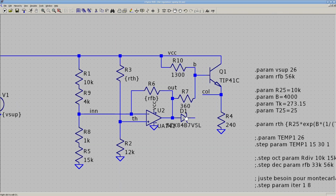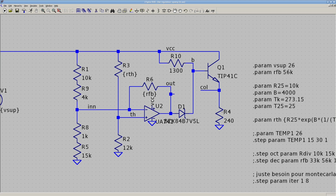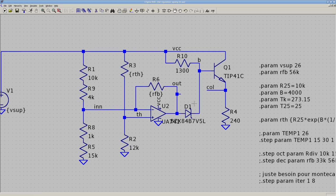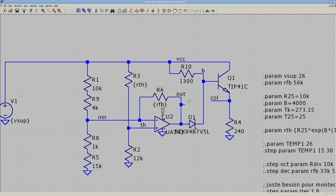That's the first thing I tried. Was a Zener diode that's 7.5 volt, and if I wire this up like that and remove R7, what this does is, with cold temperatures, the op-amp is going to be driving this output as low as it can, so maybe 2 volts for crappy op-amps. And with 2 volts here plus 7.5, that's about 9 here, so it ensures a minimum voltage on the fan, just in a different way. I didn't have a high enough power diode for that, unfortunately, because of this resistor.